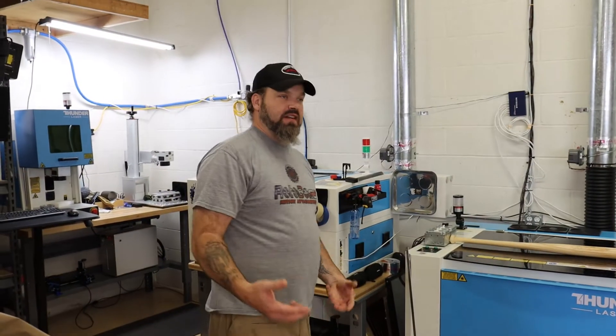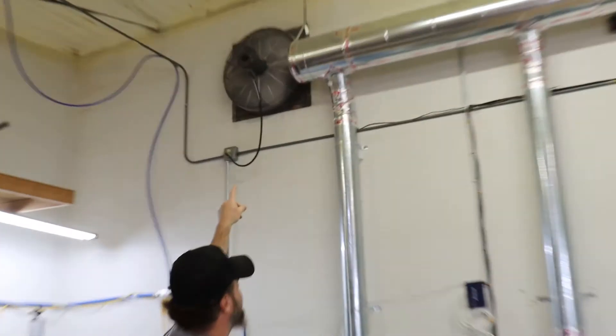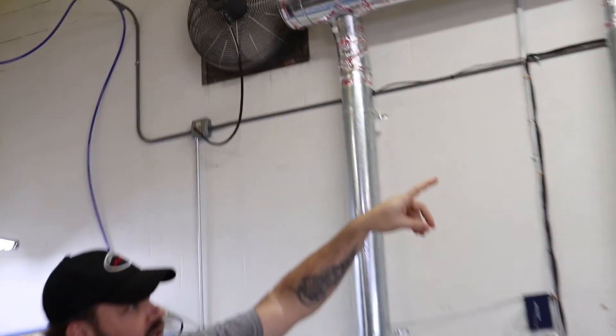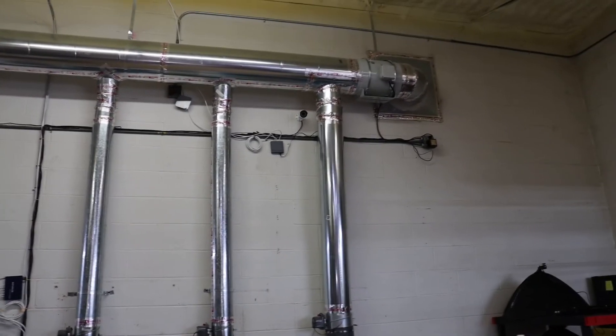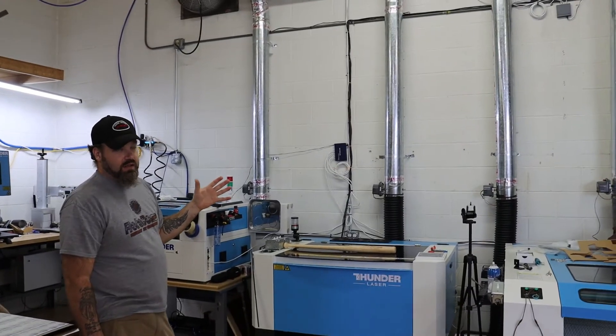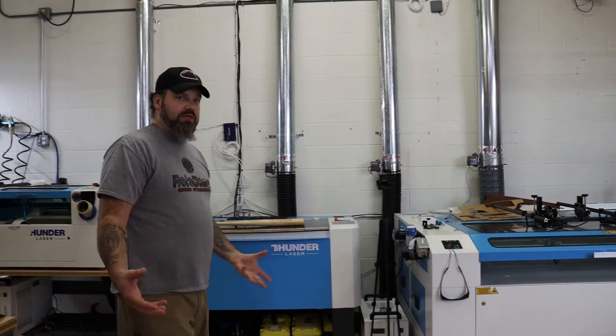That is the air system I have set up here in our shop that works best for us given what we have available to work with. Conveniently, we already have the holes in the wall and those vents, because we have an exhaust vent in case there's smoke or whatever that builds up or if we run a forklift. We just swapped it out and put the fan in for the exhaust. The same idea with the trunk line up there and individual drops would work for any setup — it would probably just be scaled down based on your situation. If you have any questions, please feel free to ask. Check out the other videos we'll have about the air system and a walk-around of the shop.